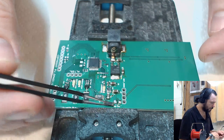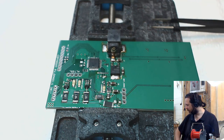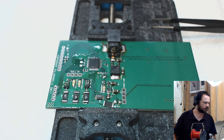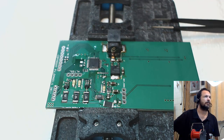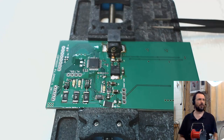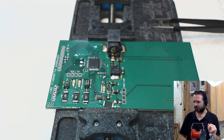There's no way a 2512 is going to fit on that. I'm going to have to go and see if I've got a 100 milliohm 1206. It's going to be an interesting find. Yeah, in your late 40s. Great. Okay. Discovered a design layout issue with this board and is redesigning it. Oh, right. Thank you, Greg, for telling other people what's going on. Right. I'm going to go grab my other box of resistors and see if I can find something.